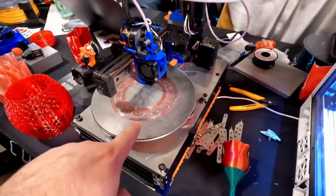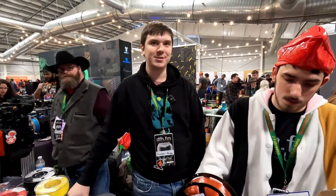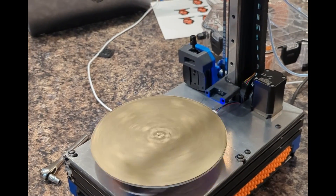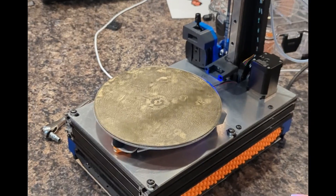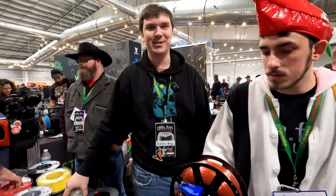This bed is heated. So how are you getting power to it? It's a four-wire slip ring — two thermistor wires, two DC bed wires. We actually blew it out in testing. We were spinning the bed around 600 RPM, and that flat-spotted the thermistor brush in the slip ring we had. So we got a new one from Amazon, installed it last night, and we're printing again.